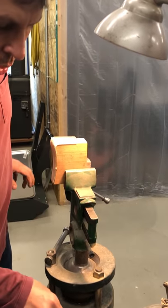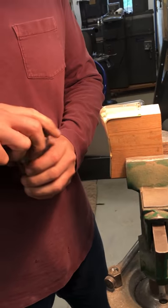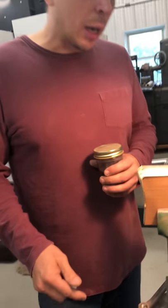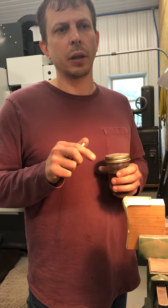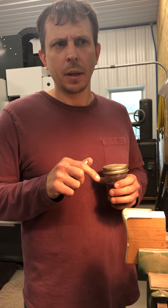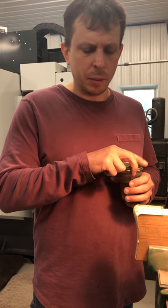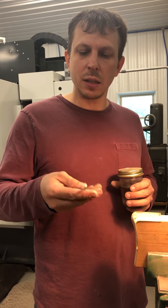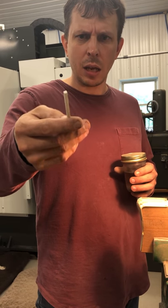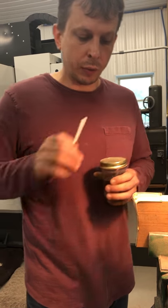So stones can be real effective in polishing. And by stones, I mean abrasive stones. And I'd recommend softer ones that break down. These are available from companies like Congress, is one that I use, and there's another big company, but it escapes my mind right now. But use the softer varieties. They come in different sizes. Here's a little one, I believe about an 1/8 inch size. It's 320 grit, which should work pretty good. And this happens to be a super soft variety.